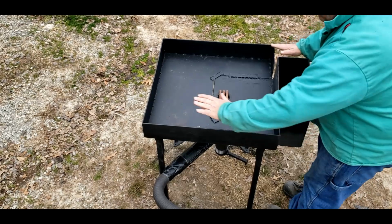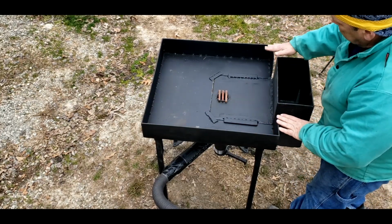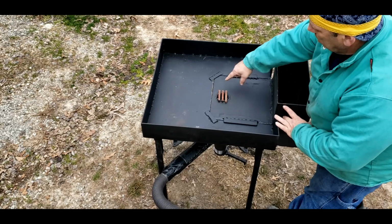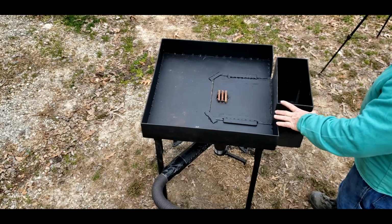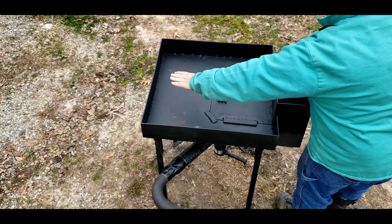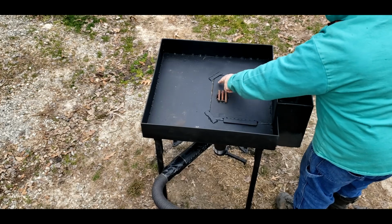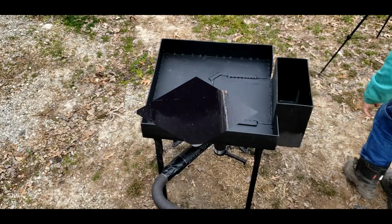What I have is the far end is tilted a little bit further down than this, so that way any water comes up here and circulates. You cannot have it tilted the other way, because if this is higher than this end, it's going to trap air up in this end of the chamber. We get some water.